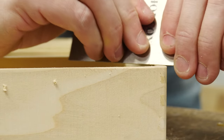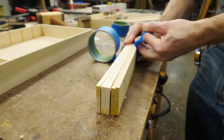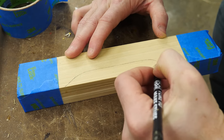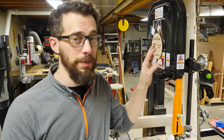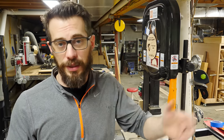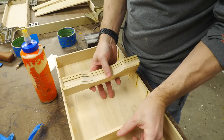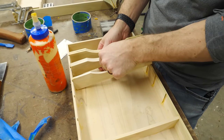It was about this point when I realized I forgot to do something. Luckily the glue was not dried on these center dividers, so I could take them out. Before we glue these in place, I'm going to cut a little notch in all of them at the same time so that you can reach in with your fingers and they don't hit the upper side. I don't typically keep a thin blade on my bandsaw — I keep a three quarter inch blade, which is not great for tight turns. So just to smooth this out, I'm going to use the end of the belt sander to get a nice even curve. The end divider doesn't get the curve because it's the biggest area and you won't have trouble getting your hand in, but on the thinner ones the curve will help you grab a single knife or fork at the bottom.